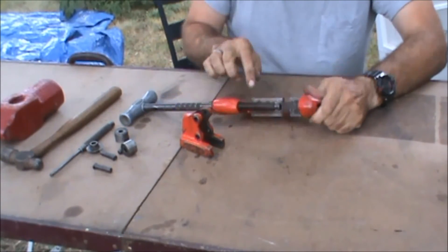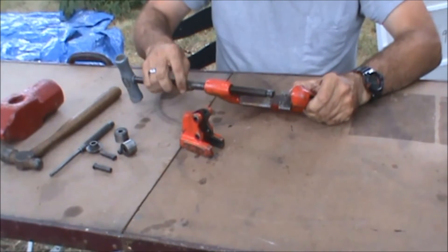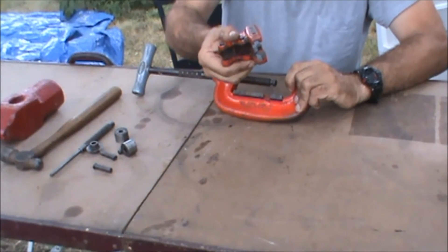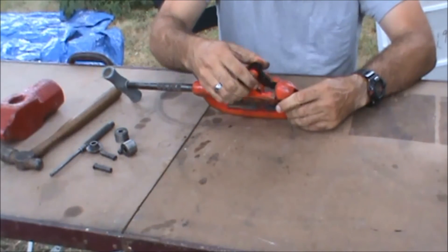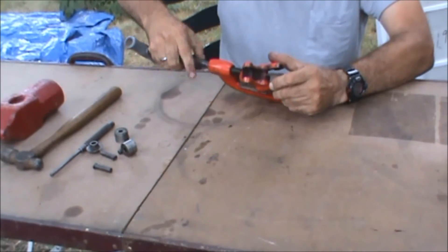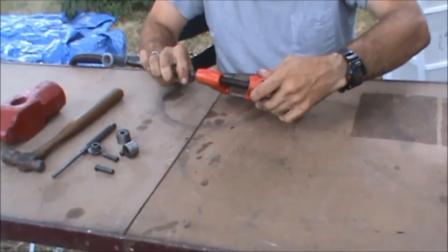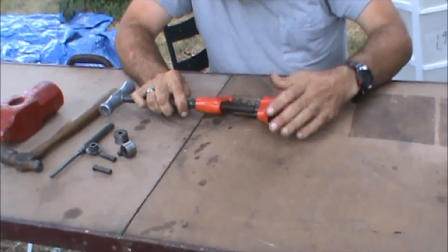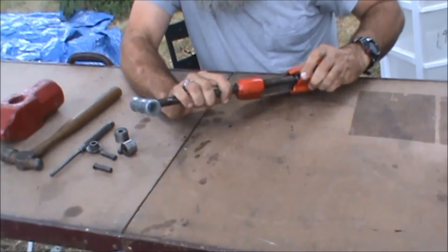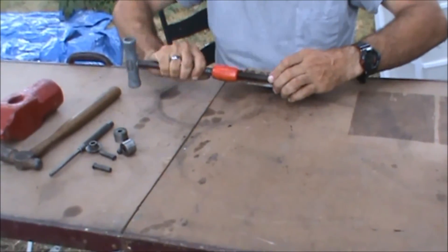To reassemble this, you just go back the way you came. Screw the handle back in — screw it almost all the way to the edge. You may want to put a drop of oil here, here, here, and a little bit inside on this slide. Then go ahead and drop that back into place. You may have to unscrew it a little bit. These things are pretty indestructible and they've made them for quite a number of years. Once you get it lined up there, you want to hook this notch over this little place on the screw. You'll have to turn the screw in and out a few times to get it to line up. If you've lubricated that, it will help the process.